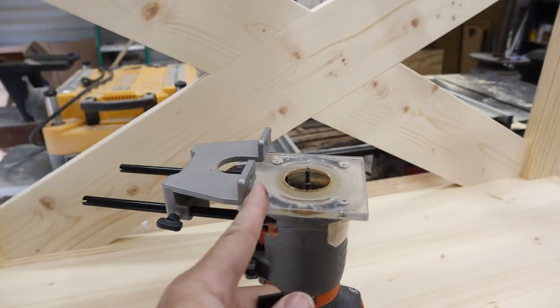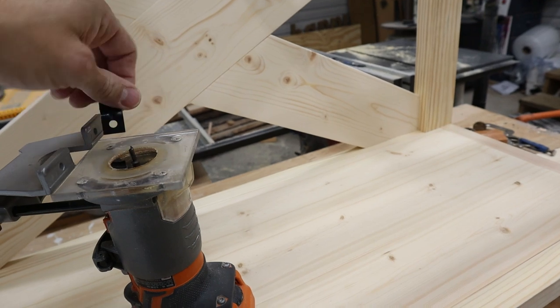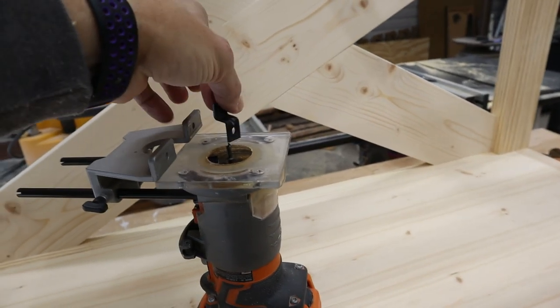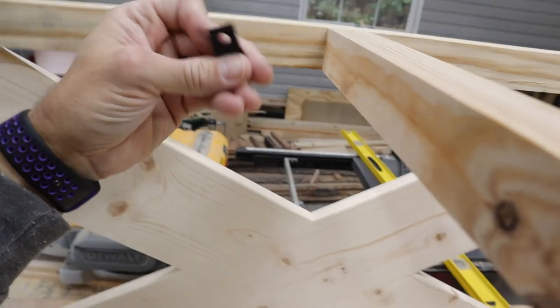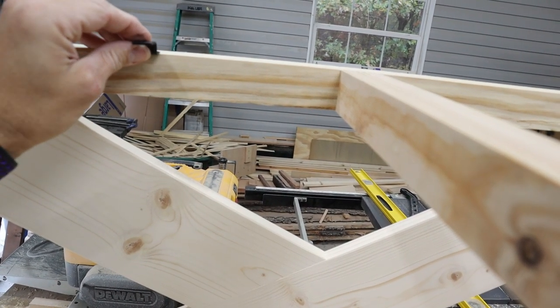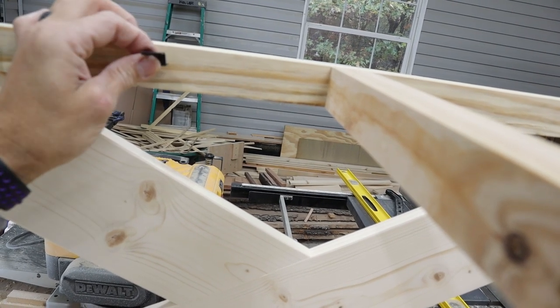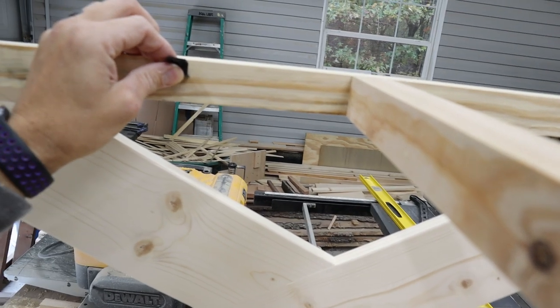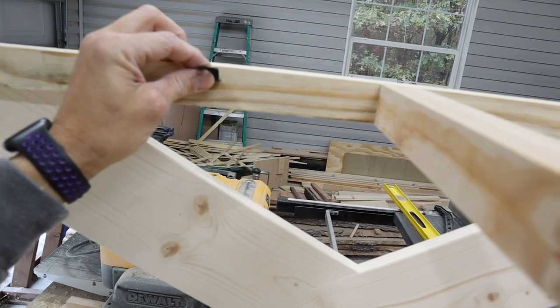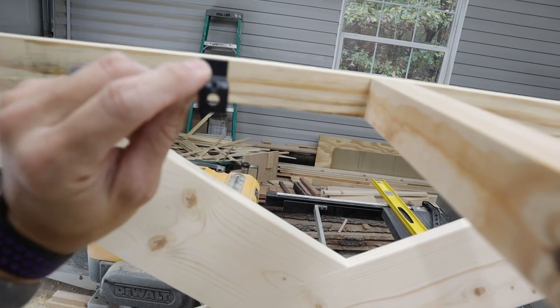Just a quick rundown on how these tabletop fasteners work. I'll cut a slot here, take this edge guide and set how far down I want it to go, and set this bit to how deep I want it to go. What happens is you cut a slot in the rail that's close to the top, and then this fastener slides into that slot. A screw goes from the underside up through the tabletop fastener into the tabletop, and it holds the top in place while allowing wood expansion to go this way or that way. They work pretty well and they're very inexpensive. There are links in the description below.